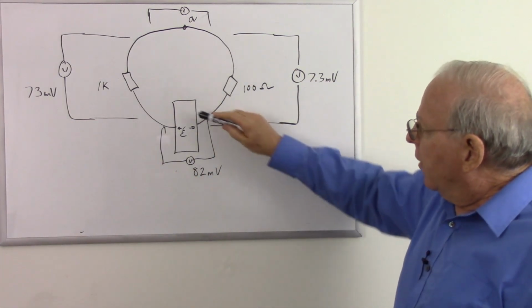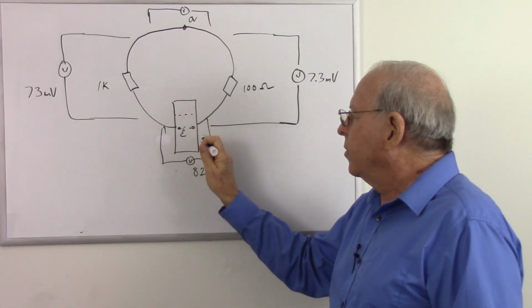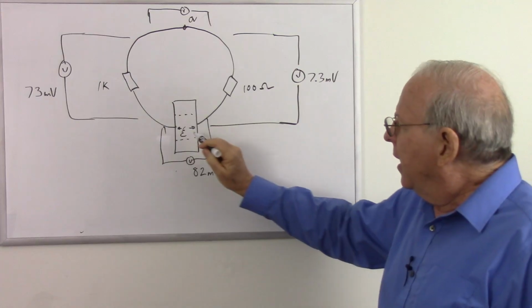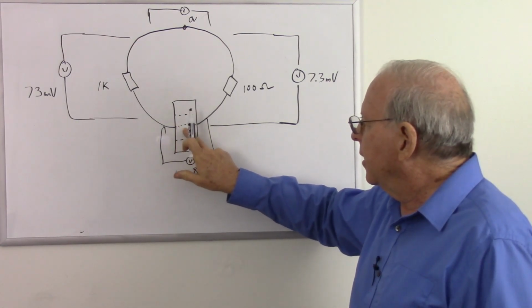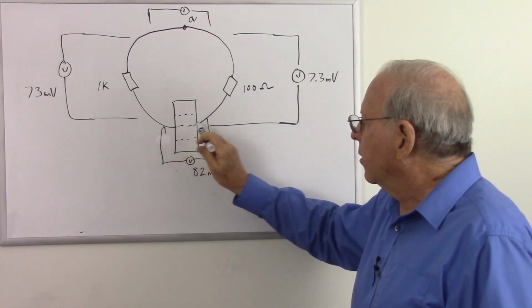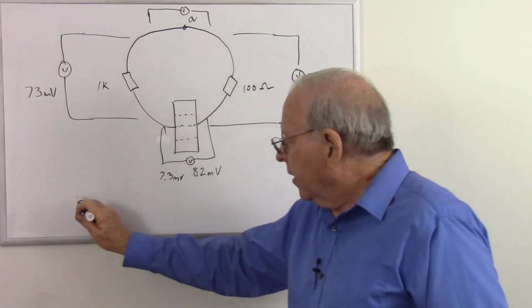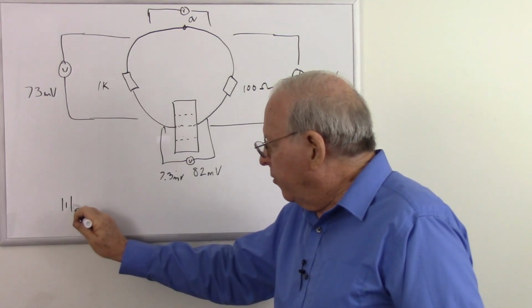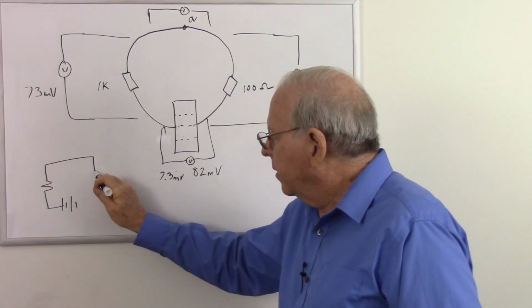we're looking at our toroidal transformer here. Let me draw my little dotted lines here so we know there's a little hole going through there. And I'll draw a dotted line for our little loop there. Let's get the electromotive force out of the way so we can see our drawing a little better. So there's our loop going through. So once again, I'll just model it as a battery because it just is easier to wrap our minds around, I think. So a DC circuit,